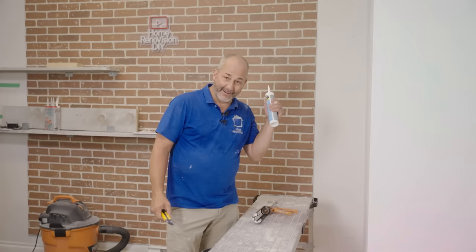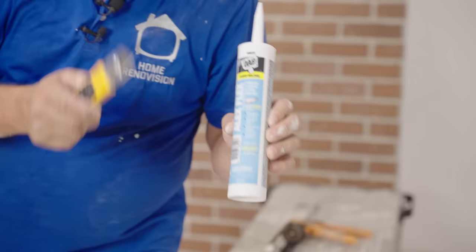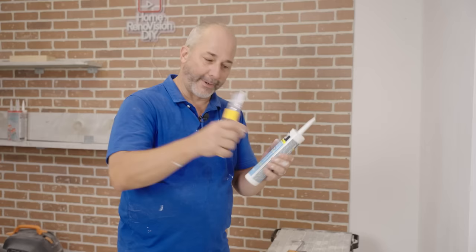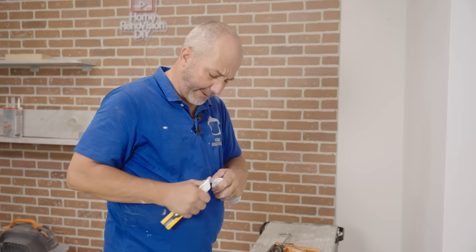All right, next step in my system. And let's get a good close-up of this, okay? You'll see it's a regular caulking, but it's a crown molding caulking. Basically what we call is a siliconized caulking, okay? It's an acrylic caulk, which can be painted with acrylic paints, so it's water-based, but it has silicone technology in it, and they found a way to bind them together. So this way you get a quick, simple application, but it also has a flexibility, so it won't crack, all right? Now that we got the flexibility worked out in an interior caulking, we're not gonna have nasty off gases.